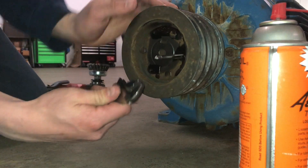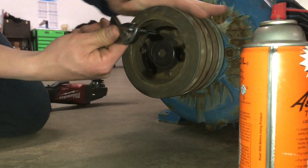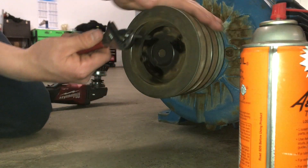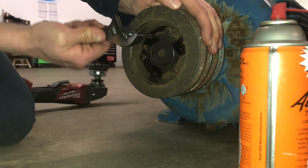There's also a bushing and pulley on the fan shaft. The pulleys are connected by a belt, so when the motor kicks on, it turns the motor pulley, which then starts rolling the belts, which is connected to the fan pulley, which turns the fan, which rides on bearings.